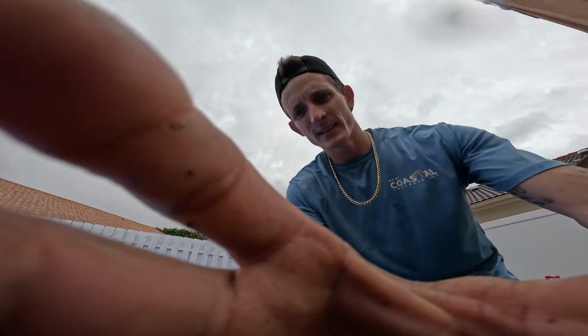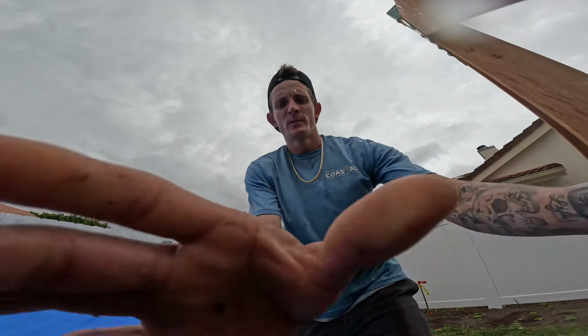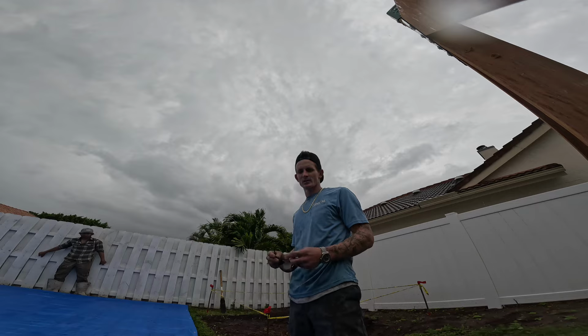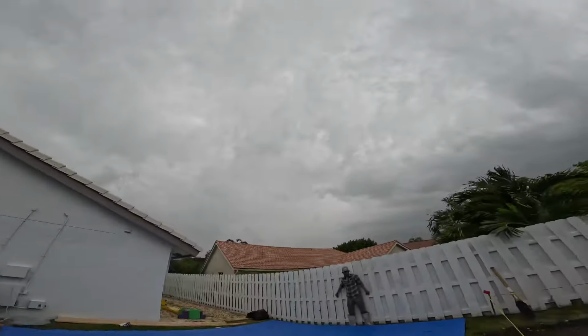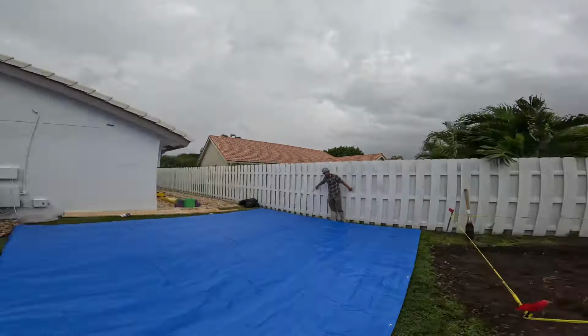If you're doing a lot of square footage, pouring a massive driveway, something big, why risk it? And waste all that plastic, rolls and rolls of plastic, almost $250 a roll for what I get. But if you're doing something like this, a small slab that's containable, and it's raining on you, you better do that damn job or not call yourself a concrete finisher. I'll tell you that. A semi good grade of tarp. Yeah, it's raining. It's going to be shitty all day. We are still pouring this bastard. Blue's a good color. All right, we're going to drape this tent up.